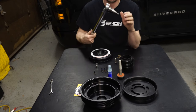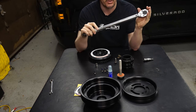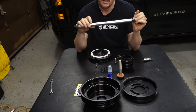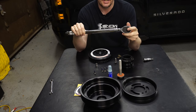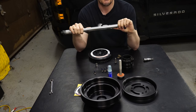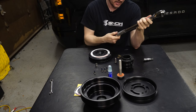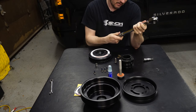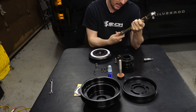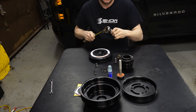When using a torque wrench, always store it on the lowest setting — storing at a higher setting will ruin it. Put it in a vise and break it a couple times to hear the click so everything's moving freely before you set it. Then set it to 16 foot-pounds to start.